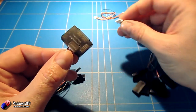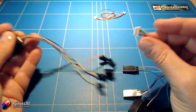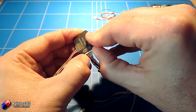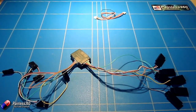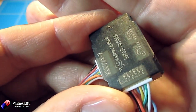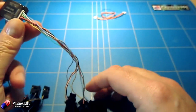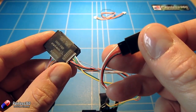The other cable that comes with it has all the right connections to plug your ESC leads into, and this one plugs into the bottom. You can plug all your bits and pieces in from there. Going back to the diagram, PWM1 is the little white cable, and it's the only one that connects PWM1 to the connector — the other two connectors in that group are the 5 volts and the ground.